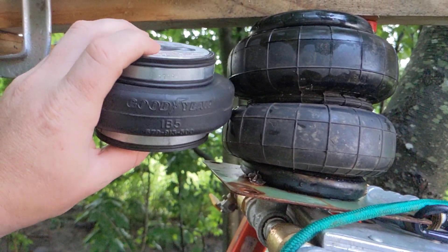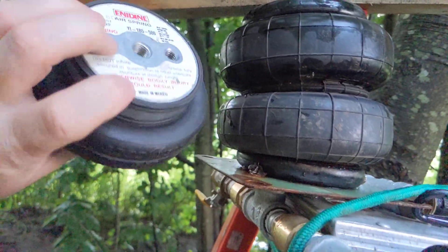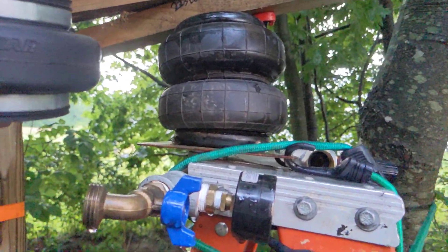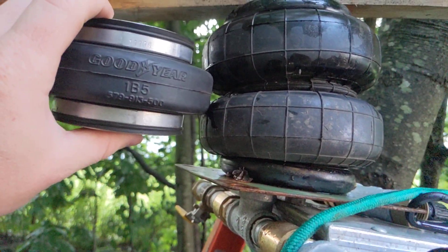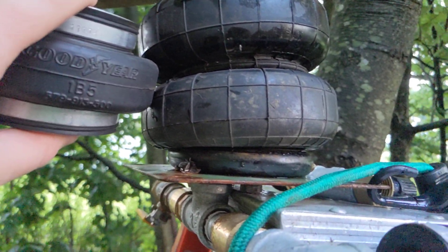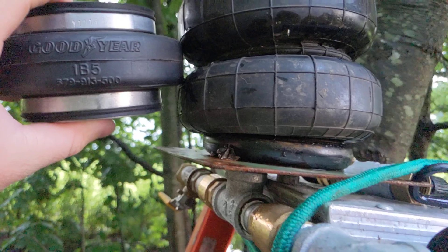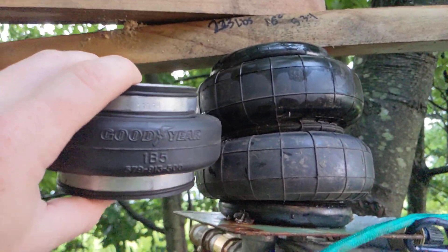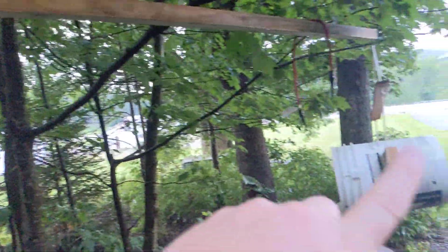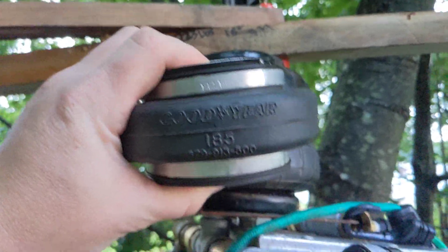One side effect of this is it's shorter — it has a two inch stroke so it compresses about that much, but it'll expand more if you put a little bit of pressure in there. With a lower source of water you can get more impressive performance. This has a much longer stroke, but this would require a shorter stroke, so you can run this with even lower fall of water — that's what I'm trying to say.